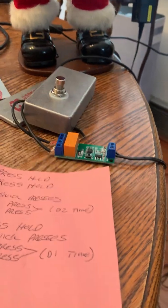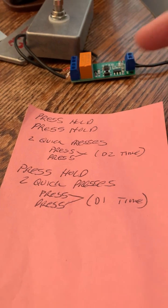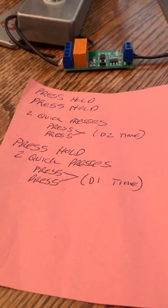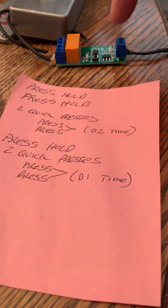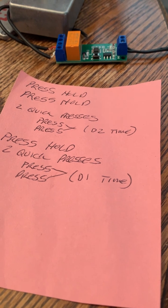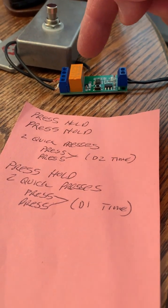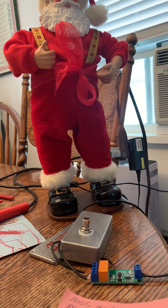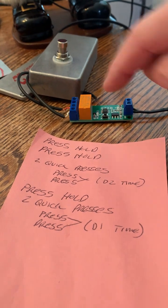He spelled it out very nicely. But one thing that helped me was to actually sit down and write out how to program this little board. There's one switch right there. The way that you program it is you power it up and press and hold once — the top light goes on for D1, direction one. Press and hold again and the second light comes on for direction two. Press the button two times and that sets you into a mode to program the D2 time. I wanted to time him to 120 BPM, which is what Jingle Bell Rock is at, so I put a metronome out and clicked it with the metronome, and it worked great.